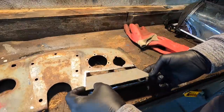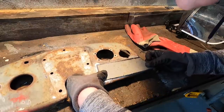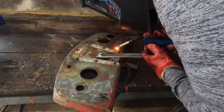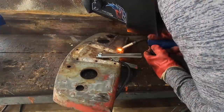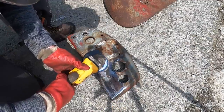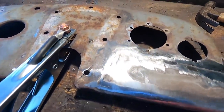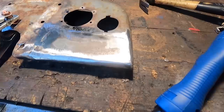You can see my cutout is fairly close — looking at the back side, we're really pretty close. I'm just going to take the grinder and go around ever so slightly, trimming little bits here and there until it fits in perfectly. Look how good that fits! We've got a few holes around the edges, so I'm going to run the welder across again just to fill any little holes and smooth out any grinder cut marks. All in all, really impressed.